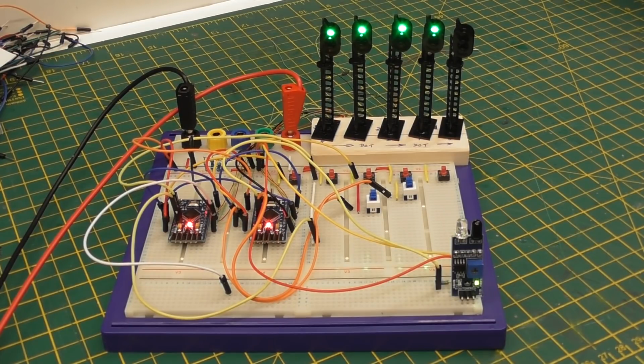Essentially, it appears that these signals can do exactly what any signal connected together with Heathcote Electronics boards can do. I haven't copied Heathcote's systems in any way, but having worked out what I needed and what was required, I then had a look at Heathcote's system, and I have come up with pretty much the same inputs and outputs as Heathcote have got. It's just that my sequencers are built in to the Arduinos, whereas if you want a sequencer on the Heathcote system, you buy one of their MAS sequencers for each signal. It does make Heathcote's system quite expensive.